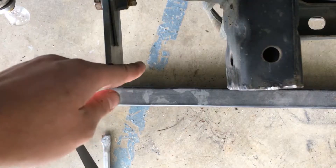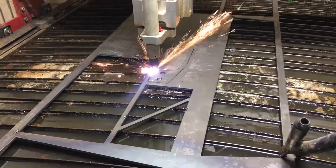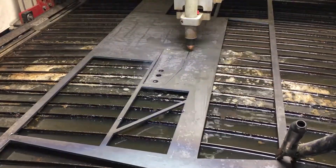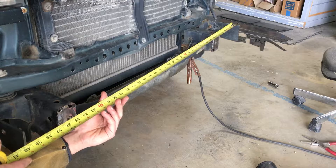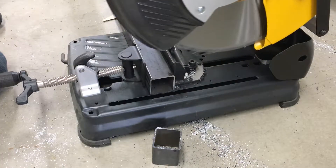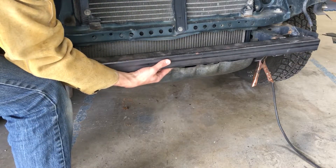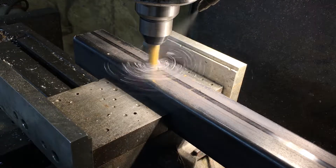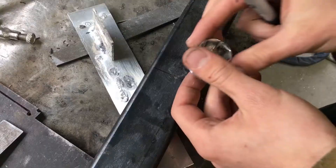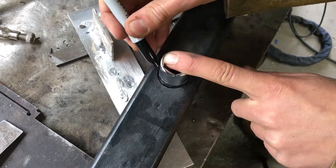After cleaning up the frame and putting on the first two pieces, I noticed that they were far too short, and I ended up having to cut a new set. For the main crossmember, I used a piece of 1/8 inch wall, 2 inch square tubing that was cut down to size and will be mounted right about here. I used an end mill to drill the bolt holes because I wanted them to have a very accurate midpoint. The other side of the holes will need to be large enough to fit a socket, so I traced one out and plasma cut the hole.